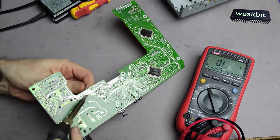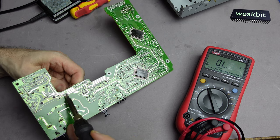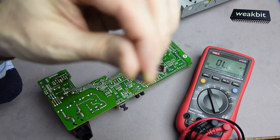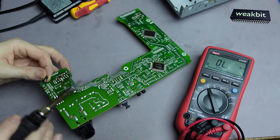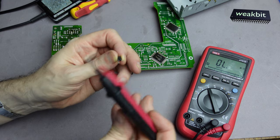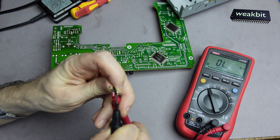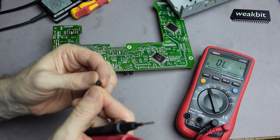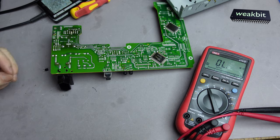You can pull it out here, and it feels like this. They are soldered. Look, it looks like a transistor, but it's not a transistor. And if we measure it now, it's nothing. But what is N15T? Maybe 1.5 ampere? I think so. 2 ampere. We built in a fuse with 2 ampere.